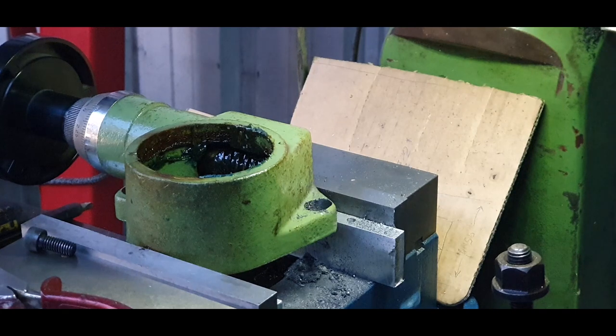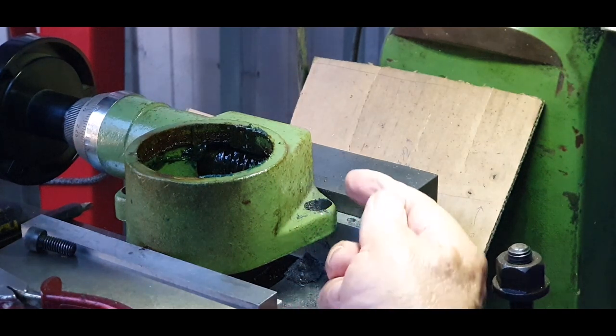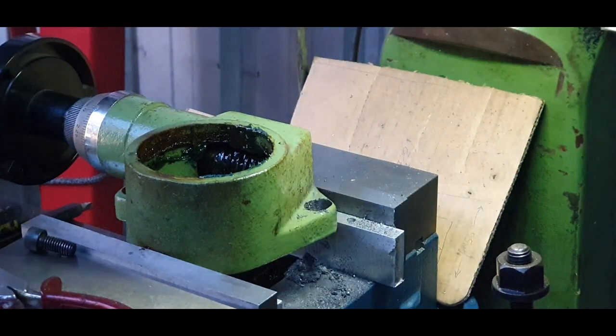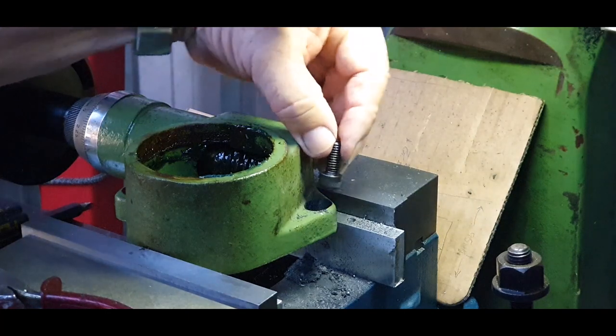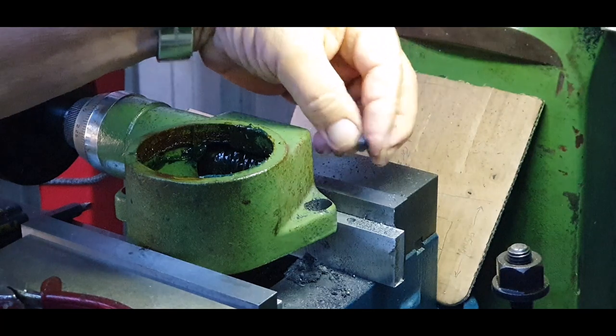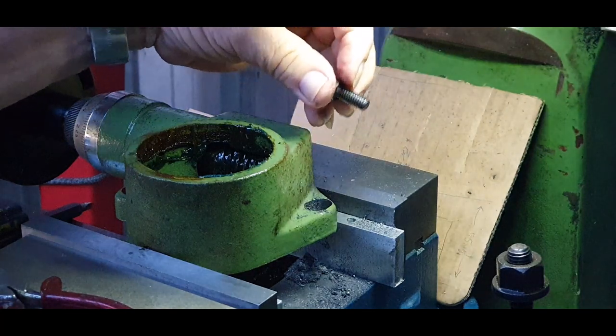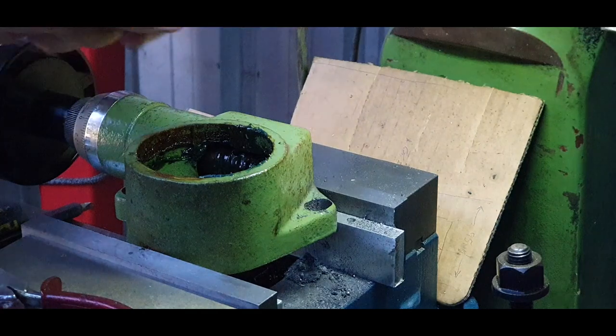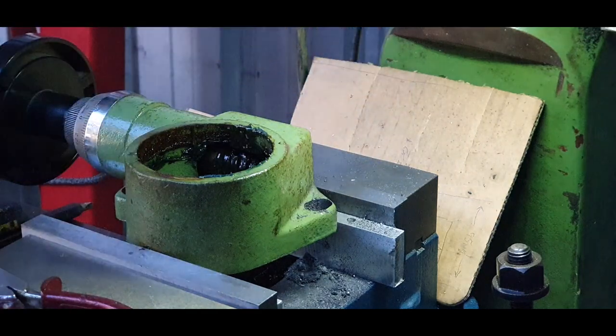Alright, we've virtually finished all this. I've elongated the main hole where the actual bolt goes through, so the head will go in there — it's got a lot of movement in there. And then I've elongated the shank, or the OD, which is the ID in this. So what I'll do is clean all this up now, put it back on, and we'll see how we go whether we've taken enough off or not.